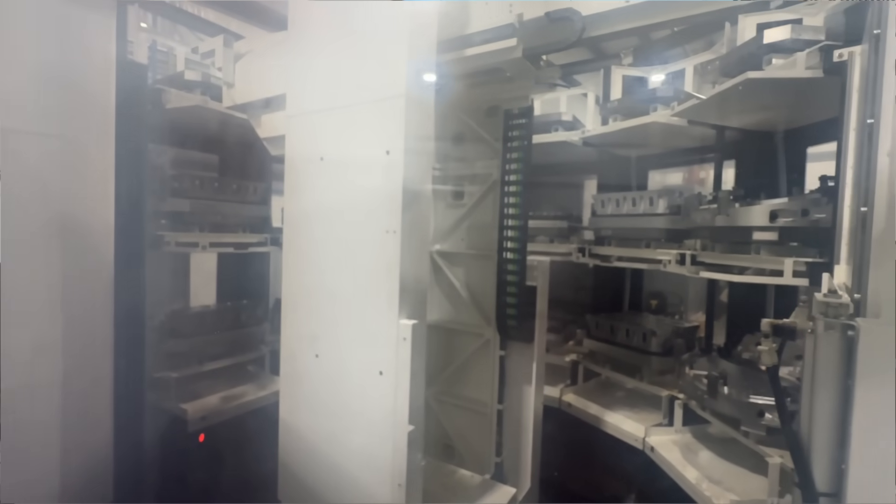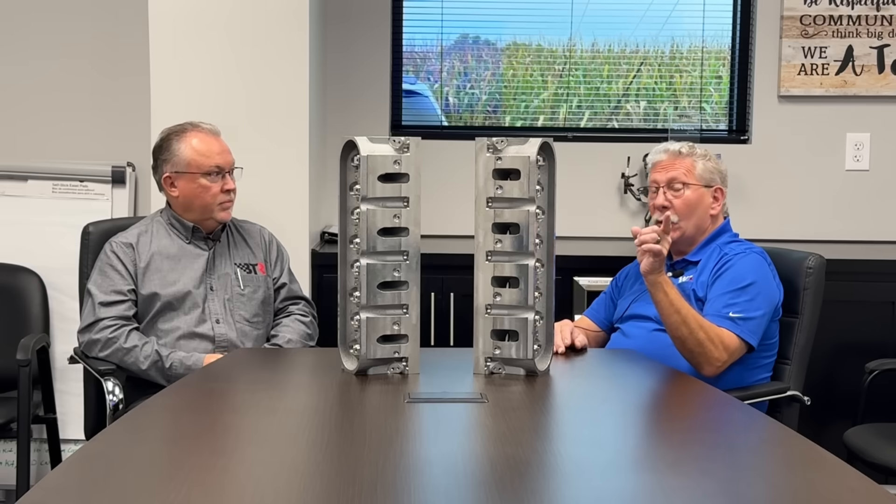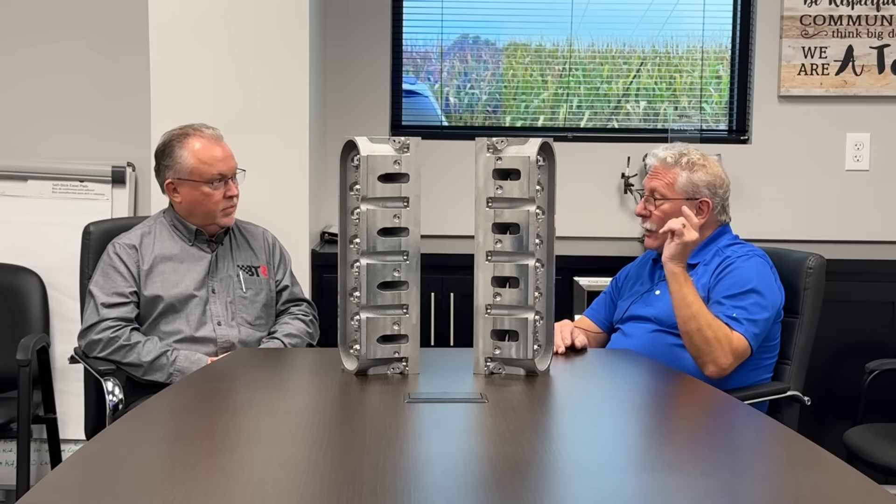We made the tooling from semi-permanent mold, meaning part of the tooling is steel. We knew we had to be cost competitive and we're very aware of the Chinese castings that are available. We made prototypes with 3D printed sand and air-set molds — very expensive, but we could make a decent part with decent mechanical properties. But there's no way we can retail that part at a profit or even sell any volume, so we had to explore other opportunities.